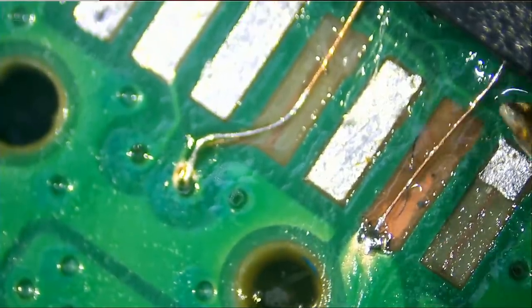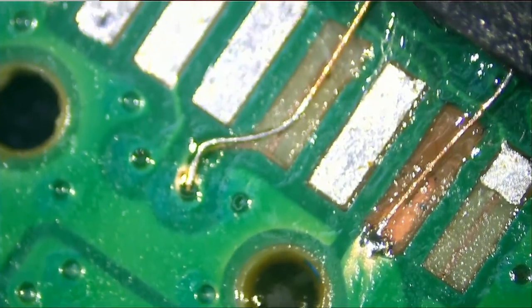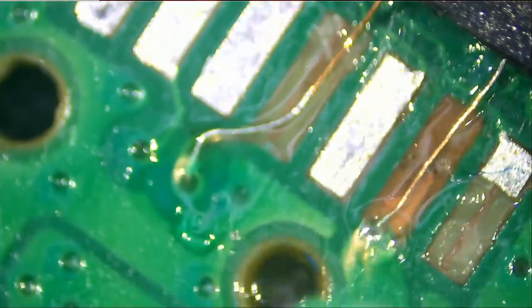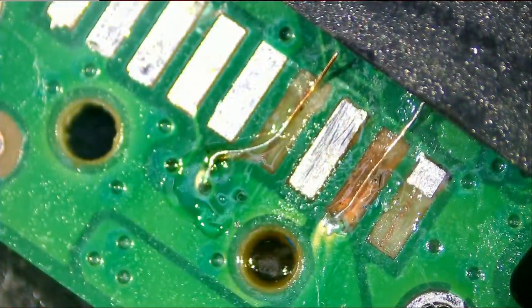It's making a solid connection and this one is making a solid connection. What we can do is add an overcoat layer on top of the wires so they do not move. We're just going to have to wait like 5-10 minutes until the overcoat layer hardens — it doesn't harden with UV light, we just have to wait until it dries out.